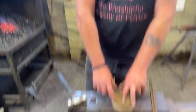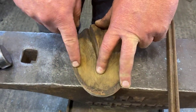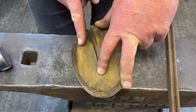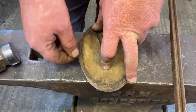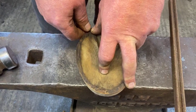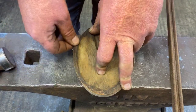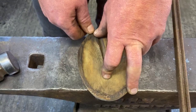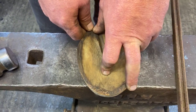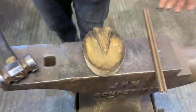Sometimes if we get a horse which is brushing more at the heel, we'll fit the shoe normal to just before the quarter, and then we'll shoe it, and I don't like to use the word, but tight, so we've got an overhang of foot, okay? It's a necessary evil. It's not how we shoe horses, certainly not in modern days, but, you know, if it's a compromise between the horse actually being able to work and not cause an injury, so it's about compromise. You know, and compromise means giving up on some of the support.